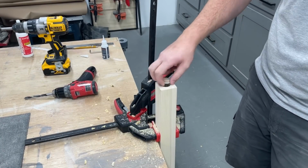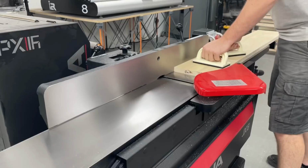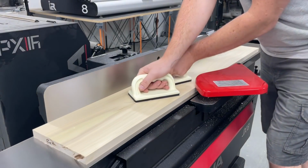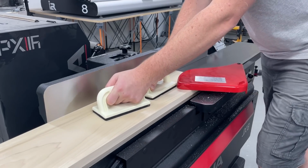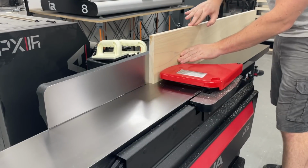Now that the legs were completely done, I could finish milling up the rest of the material. Overall, it's a good practice not to take your pieces down to their final size unless you plan on putting them together relatively soon. In my case, it had been several days, so after the initial milling and exposing new grain, the pieces could absorb or release moisture and potentially move again.